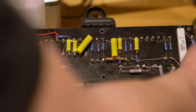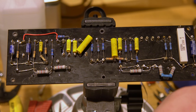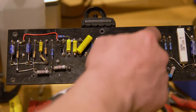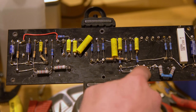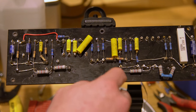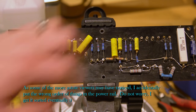It's all been readjusted. I'll have a separate board over here for the separate grounding capacitor and resistor. I'll bring the B+ in — it was going to connect into a 1k resistor — that will come across to here. This then jumps across for the grids, then jumps through another 9.1k over to these two here, which are jumpered together. This connects through the capacitors into the phase inverter's power input, and then they come back out to the 220k resistors to ground.